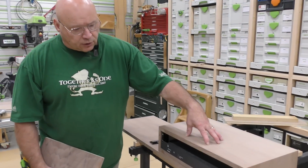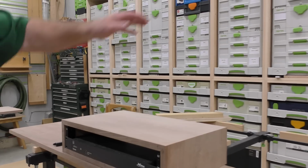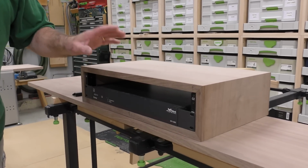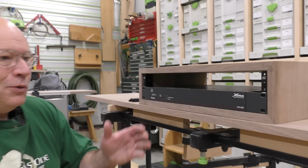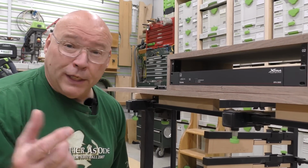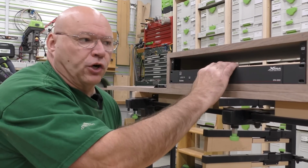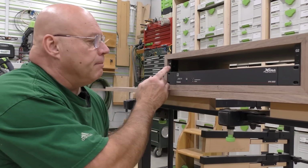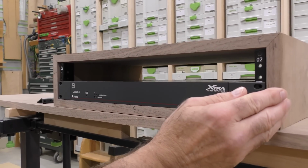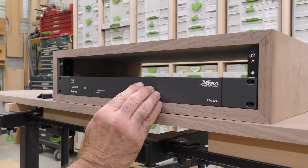Okay, so this is going to be the center console or center rack. There's going to be a monitor up top here, and this is what is known as a 2U unit. And when I say 2U, it means it holds two of these. Whether for a recording studio, I grabbed this, which is part of a server. They're all the same. The dimension from here to here, okay, is 19 inches. Now, I will go and give you the metric equivalent shortly.